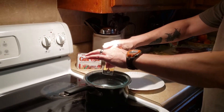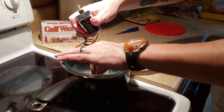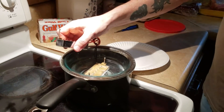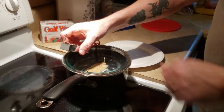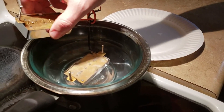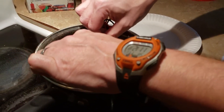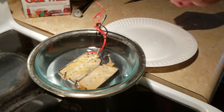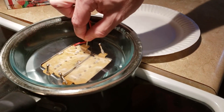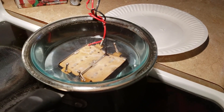I'm going to put this pickup right in here and give it a bath. I tested to see how much room was in there and I had enough room for both pickups. They're kind of tied together with solder at the ground joint, so I've got them both sticking in there and I'm just going to let them take a bath and fill up with the wax.